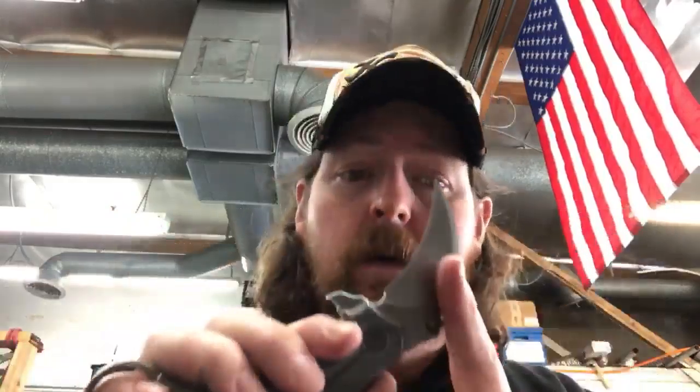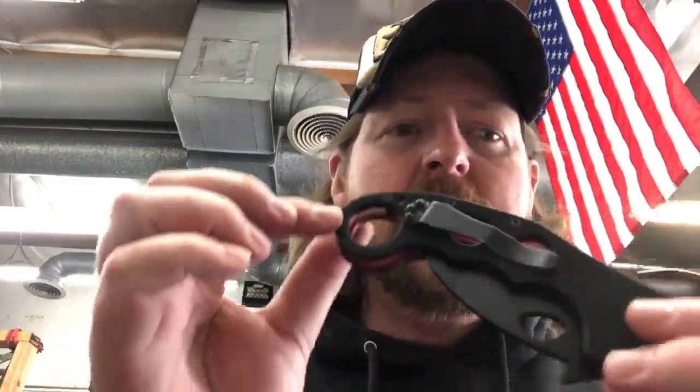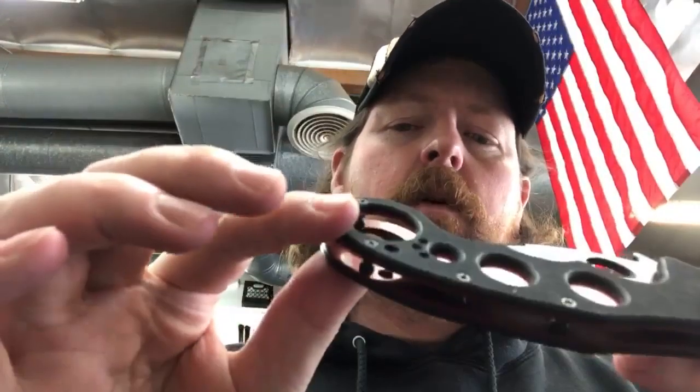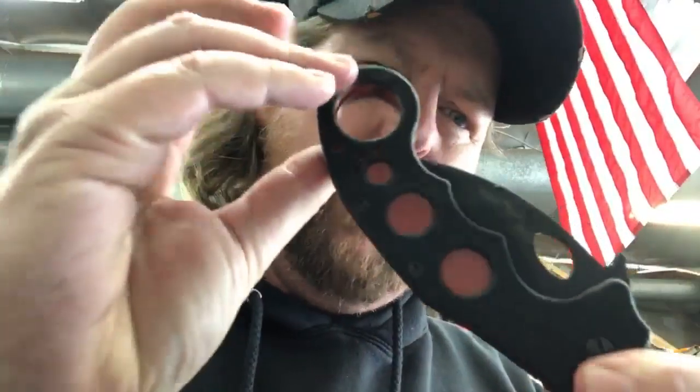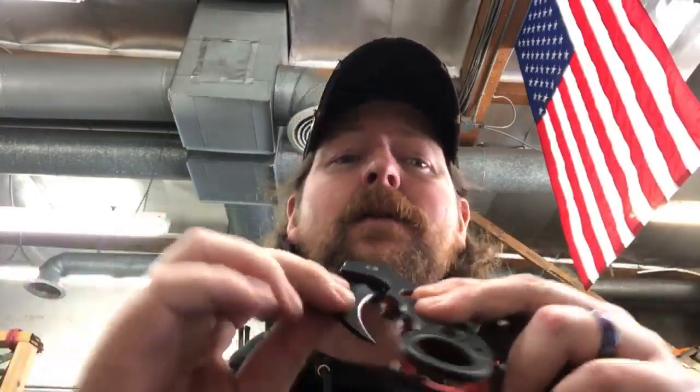The other one is S35VN, which in my opinion - if heat treated properly - is a better steel than 154CM. Handles: the Emerson has G10 on titanium liners - actually I think they might be steel liners, or titanium scales. We ceramic coated these for Matthew. The WE knife has a double detent on bearings, but the detent on the Emerson, even cranked down tight, does not hold. The WE is all titanium, on bearings, with a frame lock.